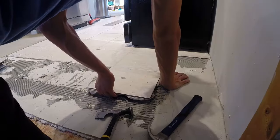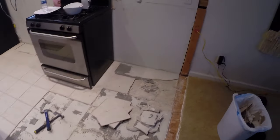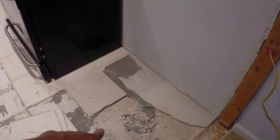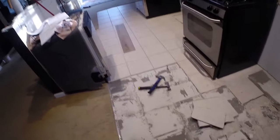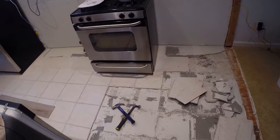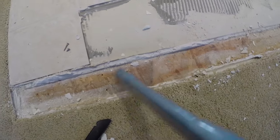The first major problem that happened for me was the concrete board under the tile crumbled and broke apart. There's basically plywood, then sheetrock, and then tile on top of that. Over here, when I'm pulling up some of the tiles, it broke the sheetrock. Seems like maybe it just wasn't stuck down quite as well, but it hasn't really torn up the sheetrock too bad. We'll see if we have to replace the sheetrock or not. Probably a major reason why this happened was because we removed a wall and there was a huge gap in the concrete board, which made it weak near the edge.